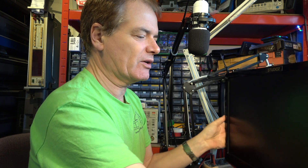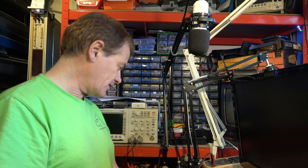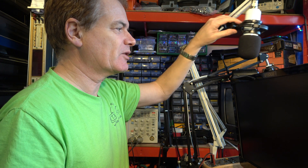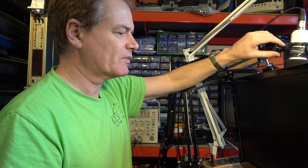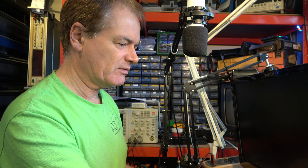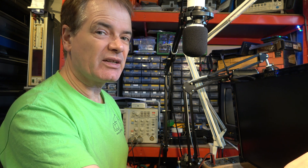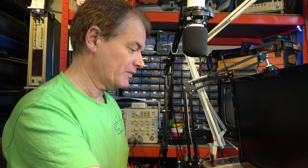Let's have a quick look at what's wrong with it. I'll just power it up here on my isolation transformer. I don't know if you can hear that — it's making a sort of squeaky noise. I press the power button and with the input button, nothing much is happening. Let's put it out of its misery. I strongly suspect capacitor failure in the power supply. Let's take it apart and have a look.